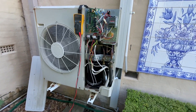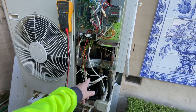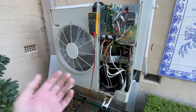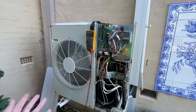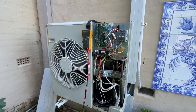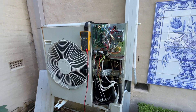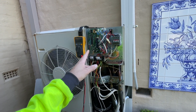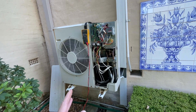I'm going to take down some details, make sure the condenser fan works, make sure the compressor works, and find out what type of metering device it is. Then I'll leave the job, give Mitsubishi Electric tech support a call and go through it with them, because I'm not overly familiar with this brand. My feeling is that this outdoor board is dead, but I want to confirm that. If it is the board and it's not available, I can just rip it out and put new stuff in — that's my thought process.